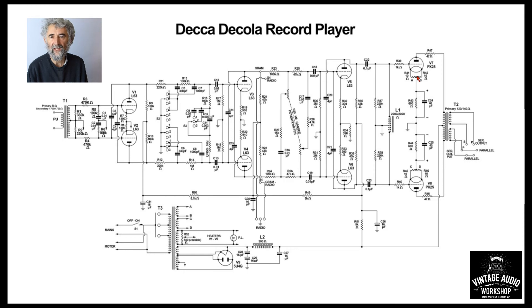There are much lower impedance valves that would have been easier to use. Made after the war, they had a choice of better valves — if they really wanted triodes, at least use indirectly heated ones, or triode-connected pentodes or tetrodes. 6L6s will quite happily replace these; if you do that you need a 6V transformer and a bigger bias resistor. I know of someone who did a restoration: because of the price of PX25s he wrapped them up safely and built a chassis with flying leads that goes over the existing amplifier chassis and plugs in — no modification to the original chassis whatsoever. He used B4 plugs into each valve base and triode-connected 6L6s, which work fine.